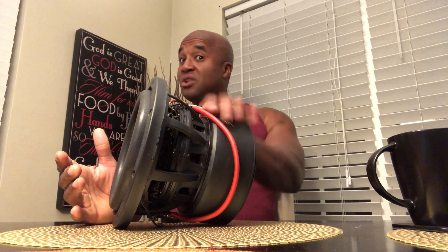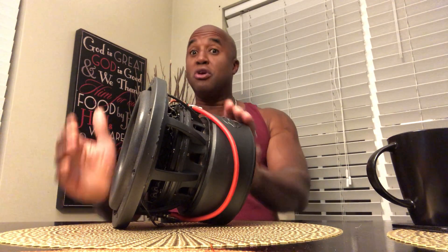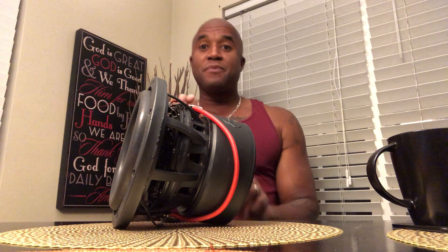So if you've got a light Mms — under 125 grams or so — you're not going to need a strong motor force, because the soft parts don't weigh that much. If it's heavier, you need more motor force to move those soft parts. If it's heavier, most times you're going to want a suspension — Cms — that's able to extend further, because you need more motor force and you need to extend further than a driver with a lighter Mms.